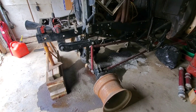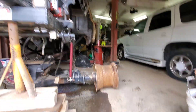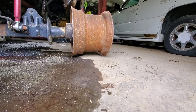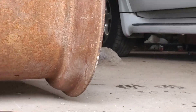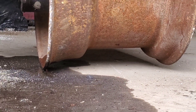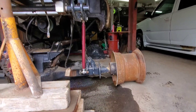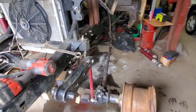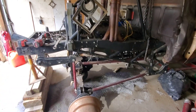So when I first built it, I never trusted the rear housing. It's pretty hard to tell in the video, but you can see the rim is in the air on that side, touching right here. That's because the rear end's got a little bit of a bend to it. But not to worry — I've got a new housing, new shock brackets, link tabs, all that stuff. Top hat too.